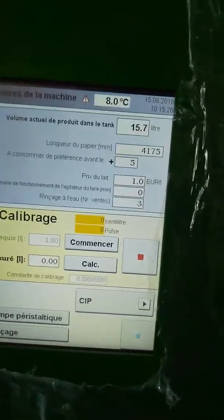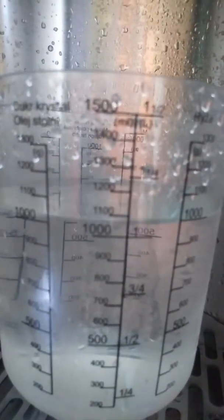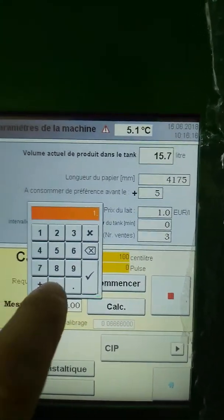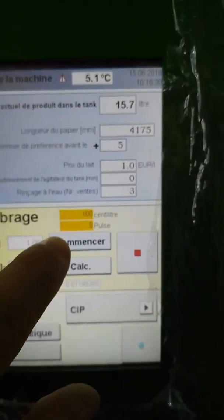We need to take out the bubbles — by tapping, for example. Now we will try to calibrate the flow meter from Comacal. We can see that Comacal is blinking blue and red — that means our milk board Comacal flow meter 32 is running. We got a little bit more than one liter: 1.09, then 1.08. I will put that in for the first calculation; it will change the calibration constant and now we will try again.